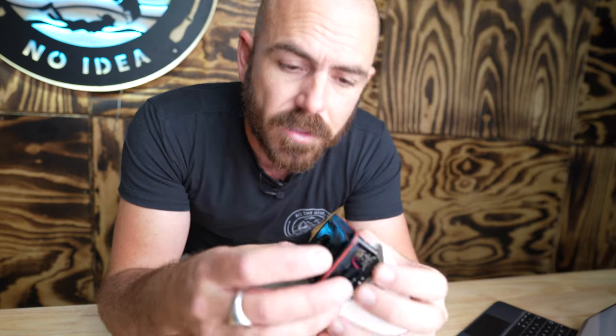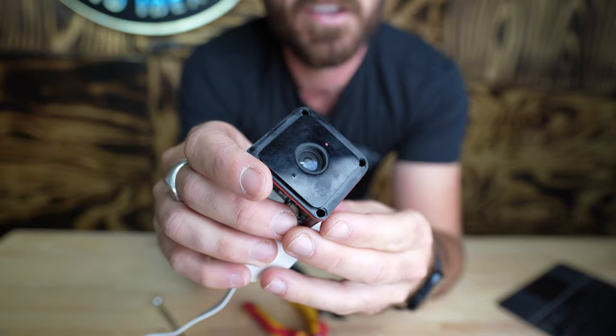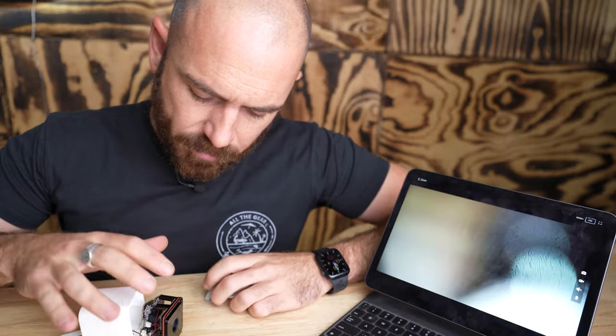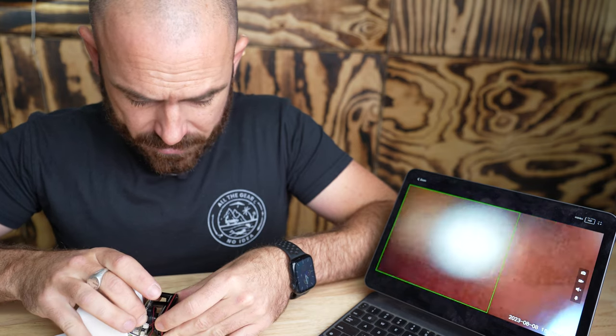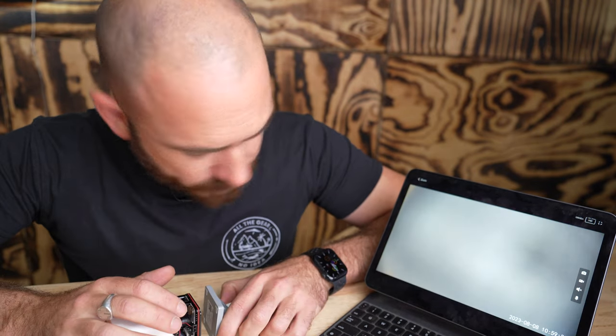We can plug the face back in. Now that our lens is loose we can adjust our focal distance. On the front we've got our red indicator LED that will go blue once we've got a Wi-Fi connection. Here is the picture we're getting from the lens and we can adjust it to the distance we want. We've got a very close focus so we're going to adjust that. I'm twisting it — our focal distance is very close, too close. We'll keep screwing it until we get a focal distance that is more appropriate. That's about one to two centimeters.